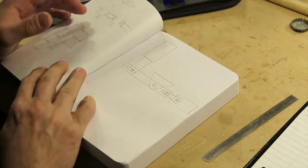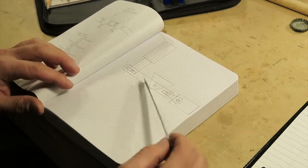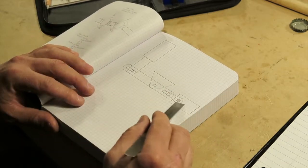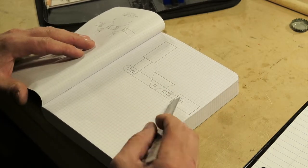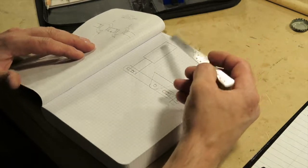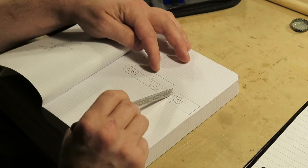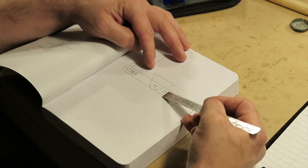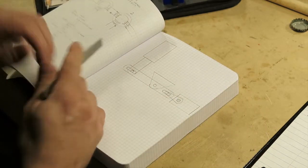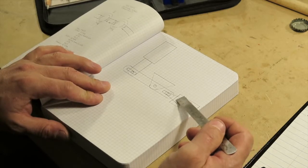All right, we're still working on this piranha plant, and this is going to be our linkage system underneath, I think. Essentially, we'll have a servo here. We've had to order some high torque servos to get enough travel out of the plant coming out of the tube. We're going to have to pivot a lever here and put the short end towards the servo, so a little bit of movement here creates a lot of movement out here, and that's the reason we needed extra torque. So we've ordered some high torque servos for this.